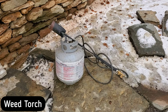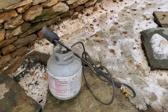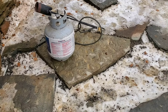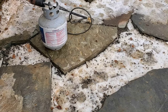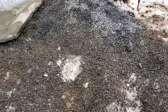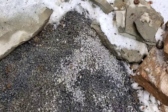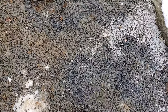Next thing would be a propane torch with one of the flamethrowers typically used for weeds. This is to help me take any kind of snow or more or less defrost stones, so I can get the snow out of this area here and melt all that. I happen to be using number eights for the most part, which is really nice because it doesn't have a lot of fines, so it typically doesn't freeze up — but it does have some fines in it.